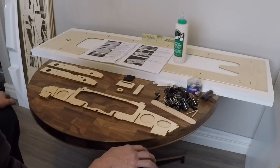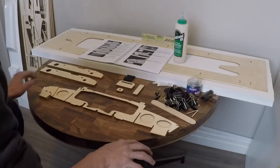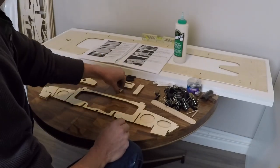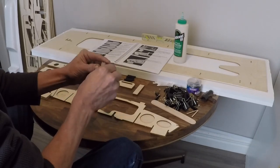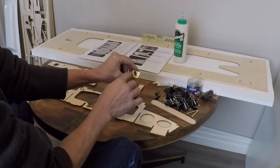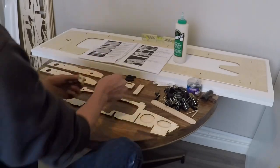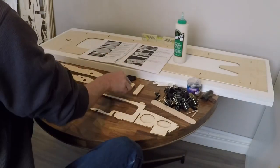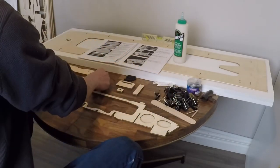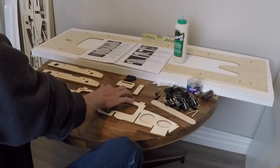So we figured today we would move on to our next step in our boat build and laminate some wood together. I took the time to make some extra rubber dowels. I'm going to use these to help me align these pieces as I glue them together. They will also help prevent any glue on the inside after I'm finished and I can simply remove them. The engine mount rails have holes that the rubber will hold perfectly, and we have some holes in the bulkheads and the exhaust mount that we can do it with perfectly.